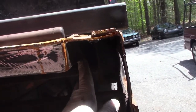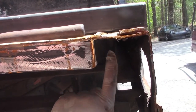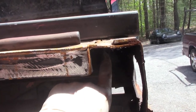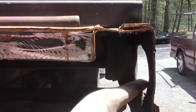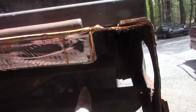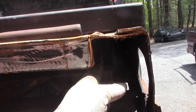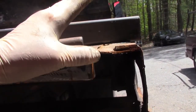Well, I've got to add some additional hydraulic power here, and I don't know if you can see it, but there's actually a buckle in the rail back here where my finger is. So I'm gonna actually get my floor jack, put a post under this, put some tension on it, and from this access that's available because the marker light used to be there, I'll drive it with something and a sledgehammer with a drift, and I'll try to get this so it raises back up. And then once that's completed,